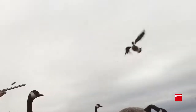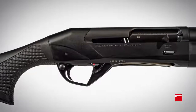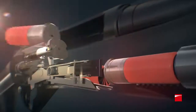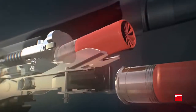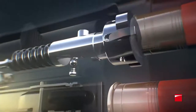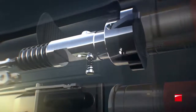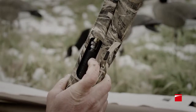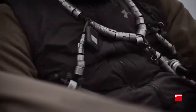Based on the legendary dependability of the Super Black Eagle platform and the inertia-driven system, the Super Black Eagle III's easy-locking system utilizes a detent mechanism that forces the bolt to rotate as it closes. This system ensures that the bolt always locks into battery no matter how lightly it's brought forward.